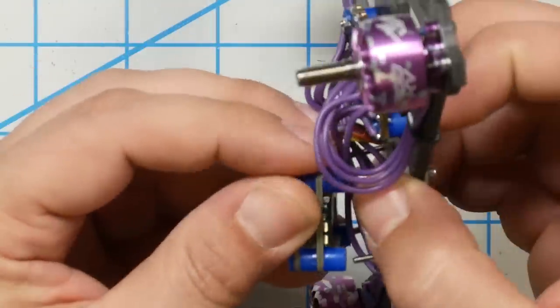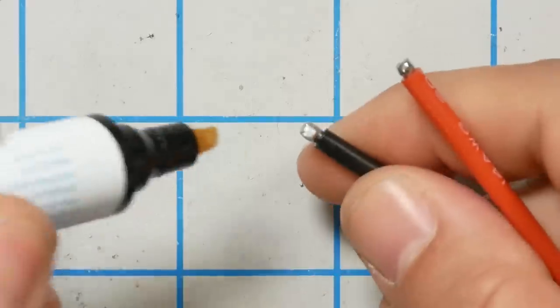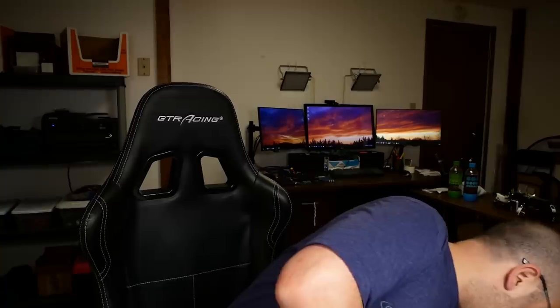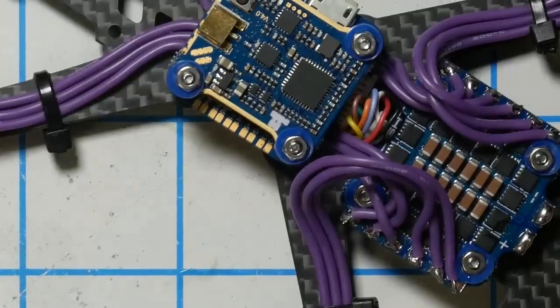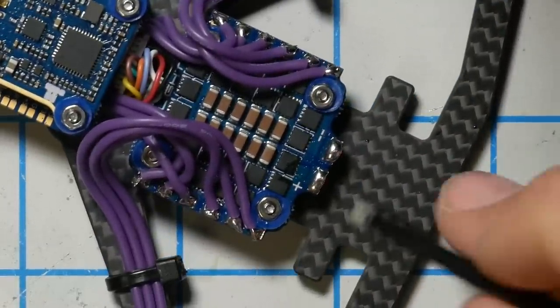When you install this, make sure you're not pinching any of the wires — it's an easy mistake to make as you push this down, and tightening it could damage them or cause a short circuit to ground. I'm going to add some fresh solder to the pigtail and put a little flux on the wires. I prefer liquid flux in a pen, though flux paste or a syringe applicator is fine too. I'll turn my iron up to 850°F — for these 14-gauge wires I think it's appropriate. Make sure you do black to minus and red to plus — don't get that wrong or you will regret it.